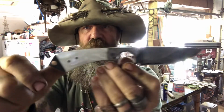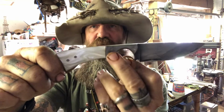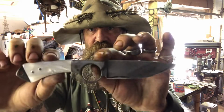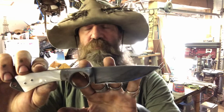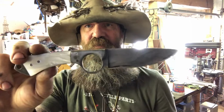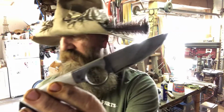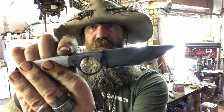And again, let's take the persuader off the end and just look at it as high carbon steel, a handle, and bolsters. This one has a finger ring. Let me just tell you that the hole is not so hard to drill necessarily, and the bolsters attach the same way that they do on a full Tang knife with just bolsters, but this is incredibly more work than just attaching bolsters to a Tang that's straight. This one has the hole in it, all the shaping that goes on inside of here, and all that.